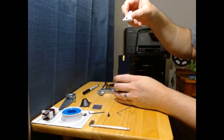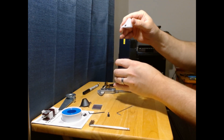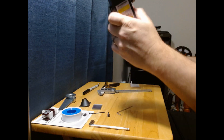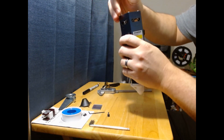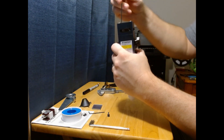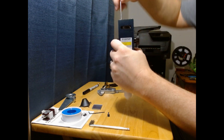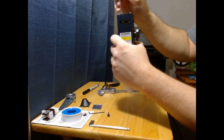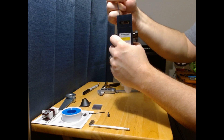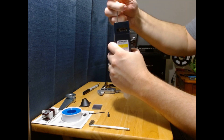At this point we're ready to start feeding in the nozzle partially. Remember, the screws are still installed on the other side, so we're going to slide it in until you feel resistance where it pushes up against the screw, and then stop. Flip it over and very carefully keep the thing straight up and down as you remove the screw right above where the tube is coming through. Remember, the screw is the only thing holding those spacers in place, so we essentially want to insert the tube as we pull out the screw — loosen it up until it's no longer grabbing the threads, then feed the brass tube through and use it to push the screw out. But again, be gentle. Brass is very soft and if you're not careful, you'll bend over the tip.